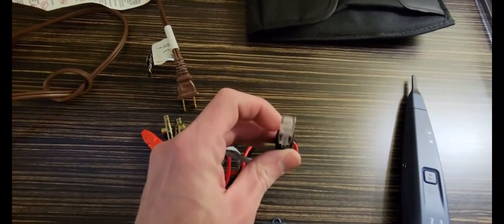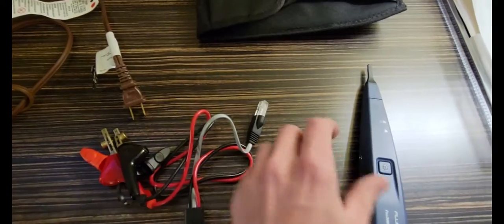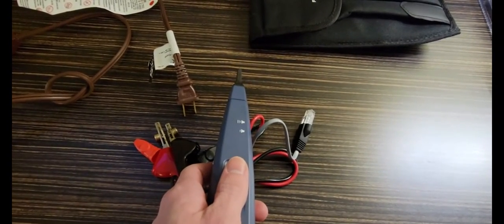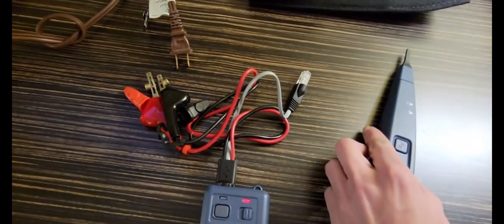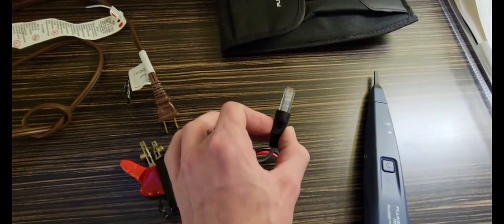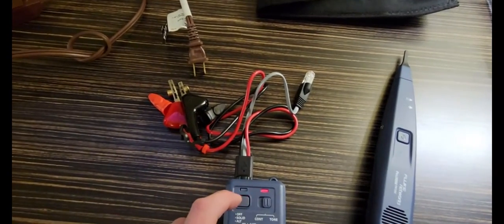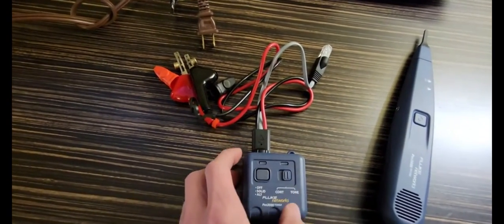To use the RJ11 jack, simply plug it into a female adapter and trace your cable the same way. Hold the power button on the probe wand over your cables, getting closer until you hear the sound as loud as possible — that is your cable. To verify, strip back two of the paired wires inside the RJ11 cable and touch them together. If you hold them for two seconds, the sound will change to confirm the correct cable.